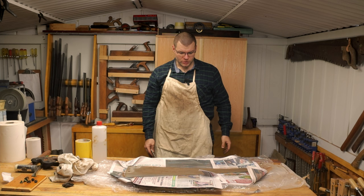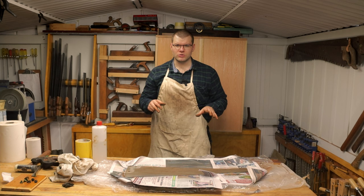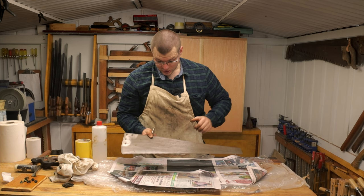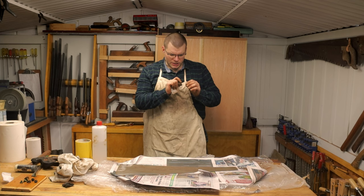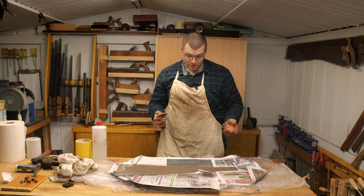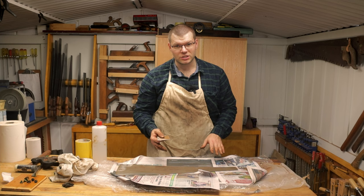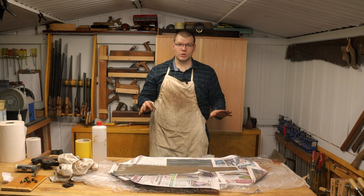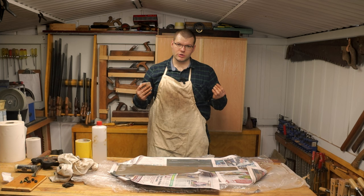Obviously if you've got a lot of deep pitting, you're not going to be able to restore a saw as well as one that has minimal pitting. It always pays when buying secondhand tools to look out for signs of pitting, darker colours, and different shaping on the metal. Ask for more photos if you're buying online or from auctions, and in person have a very good inspection of the tool. Try to make sure you get a saw plate that's straight and has all its teeth — none of them broken off. Although we can reprofile teeth and re-add them, it's just a lot more work. If you spend a little bit of extra time obtaining the tool, you'll have a much faster and easier result when you come to restore and use it.